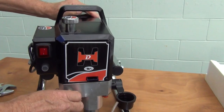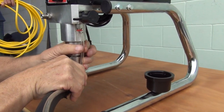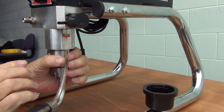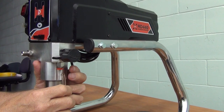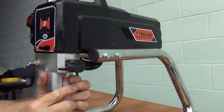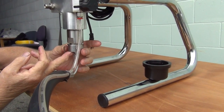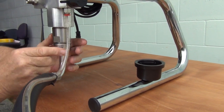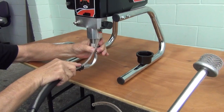Looking at the machine in terms of assembly, there's one important point you must note. This is the suction hose, and it fits into this red knob fitting simply by pressing it up — that holds it in place. It's most important that you recognize this because when you come to clean the gun after use, you need to remove this hose by pushing the red fitting up and sliding the pipe out. There's also a spring clip which holds the suction line in place on the pump; there are three O-rings inside there, making it very easy to remove for cleaning. The spring feature allows the pipe and suction hose to be twisted to suit the bucket of paint you're going to place it into.